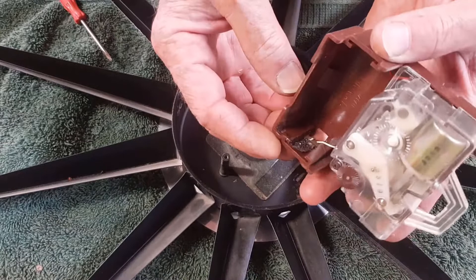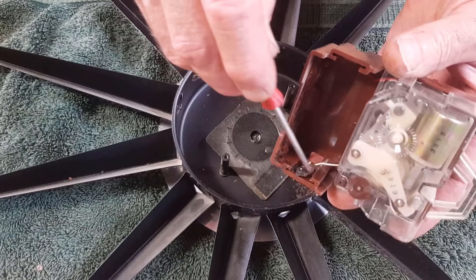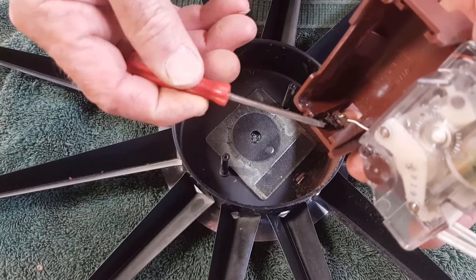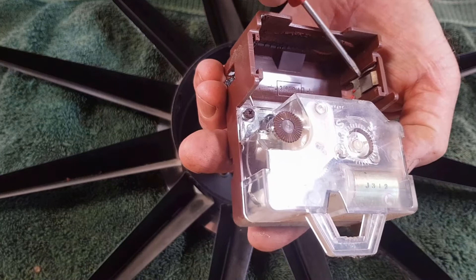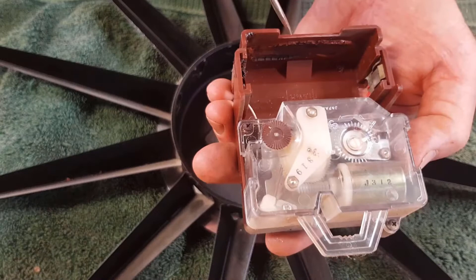Now I've got to have a look at this terminal and see what we can do. It looks like they slide into slots - that's the good side. It's a sheet of spring steel that slides in and has a wire attached, but pretty well the whole center of it is just corroded away. That's supposed to be spring steel and there's hardly anything left. I'll dig all that out - I'm probably going to have to make something. I'll get the other side out as a template, get the right width so it slots in, and solder the wire onto it.